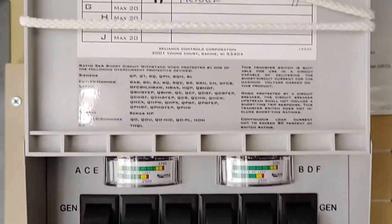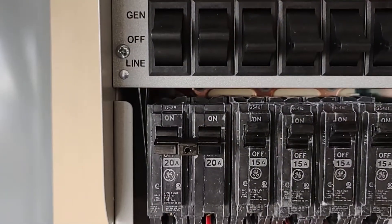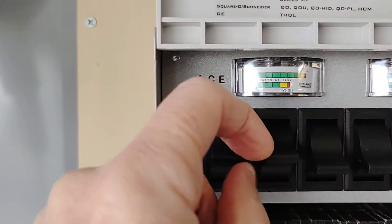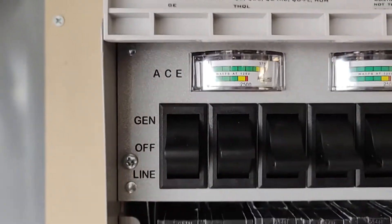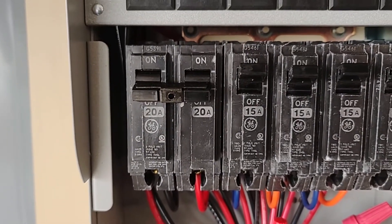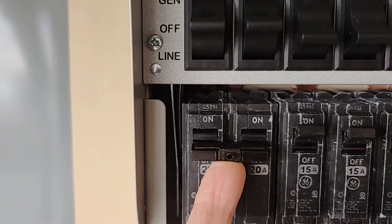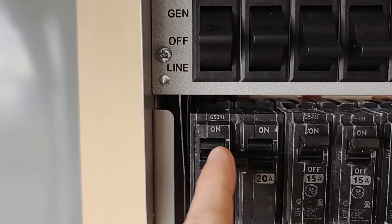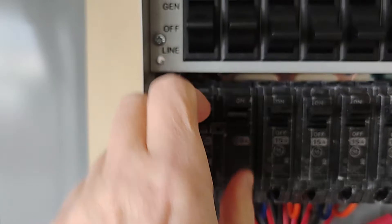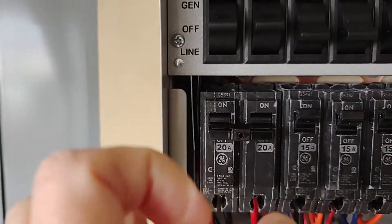I have four circuits on there and I don't really need the 220. So I have removed the little connector, which you can unscrew, and it comes out over here. If you go to the website, it'll tell you that. And then I have the two breakers here. I'll take those off in a minute and show you. But I didn't take the interconnect off because it looks like it's somehow permanently on there, and earlier when I did unhook these, it looked like these were joined as one — they weren't like two separate ones. When you take them out, it's still one unit.